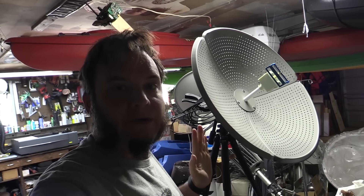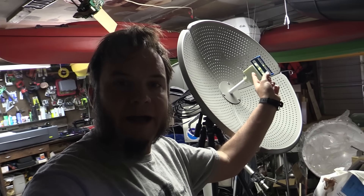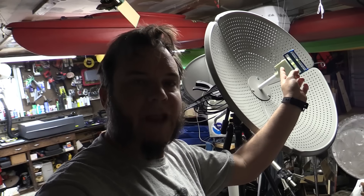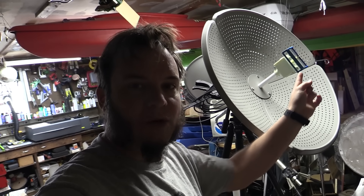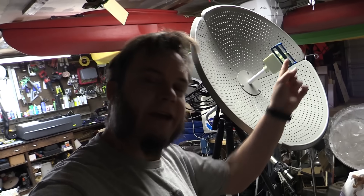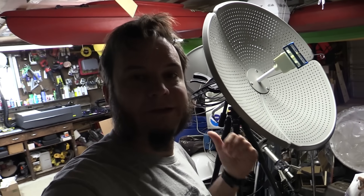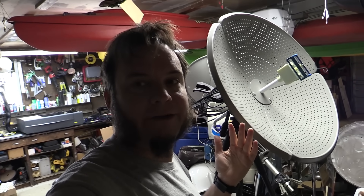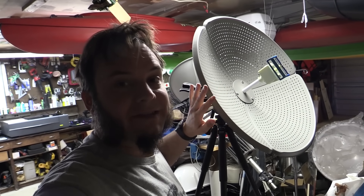There are other antenna types you can use for the GOES weather satellites. This is a Discovery dish with a little dipole feed in the middle. This is a traditional prime focus dish, so radio waves bounce once and go to the center of the dish — not bouncing again into the back of the dish. We could do something like this with that 34-inch 5 gigahertz dish. These Discovery dishes are a great way to get into satellite tech and satellite listening — I'll throw a link to their website below.